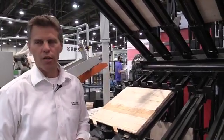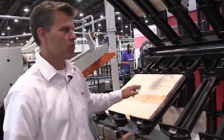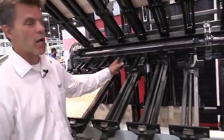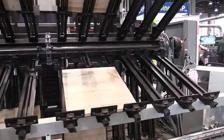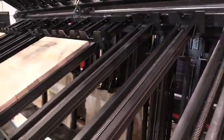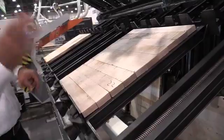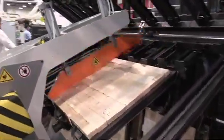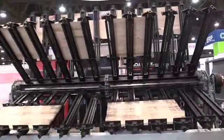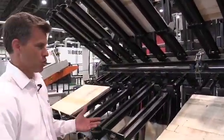Coming with the AGS automatic glue spreading and loading device into the clamp carrier, we were also driven to change the design of the clamp carrier to make it more efficient. One of the biggest changes is that we're now adding more clamps to every section, and they are fixed in position — meaning the operator never has to move the clamps anymore, and there is always a place to load the panel. The operator's task is simply to cover the hole on the clamp, which signals it will be tightened by the robot tightener. We also added a wider 8-inch jaw clamp versus the typical 5-inch jaw. Some users have told us they gain 25% more throughput with the fixed clamp version of their clamp carrier.